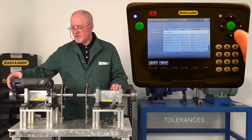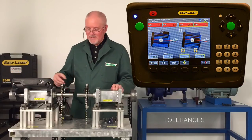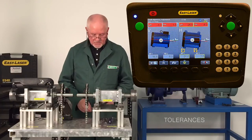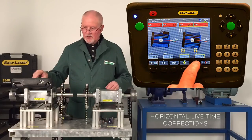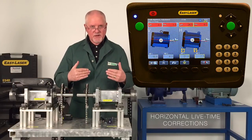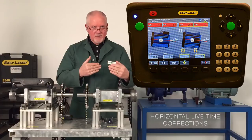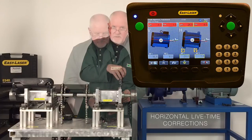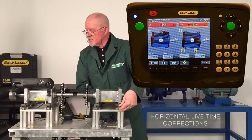I'll set a tolerance. The most popular RPM is 1725, which falls between 1000 and 2000, so I'll accept that. As you can see, they're all in the red, so I need to make corrections. I can see it's 21 thou that I'm going to move the foot. When you want a true live reading I always like to trim the horizontal plane first, because as the two circles come together, getting closer in the horizontal plane might change the vertical slightly. I'll trim it — it was minus 21, now down to minus eight and a half.